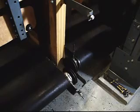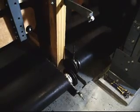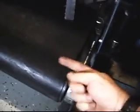Alright, so now it's time to take this roller out. I'm going to show you on this side. This can be done by one person, but it's kind of hard to do it. I'm going to go ahead and tip this all thread forward so that whenever I pull it, it's going to go under this mat. It's actually laying right about flush with it, or it's about an inch below it right now, just to let you see. I'm going to pull it straight through. I'm going to just have to finagle it a bit and bring it out the other side.